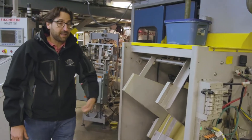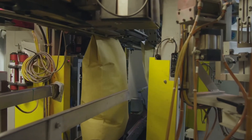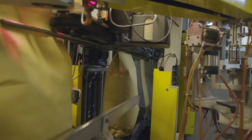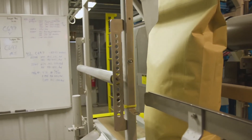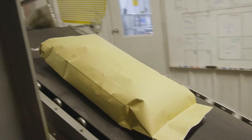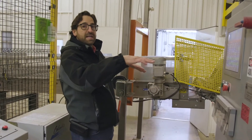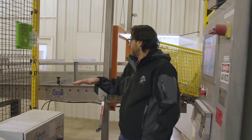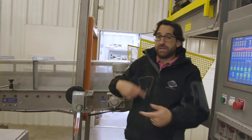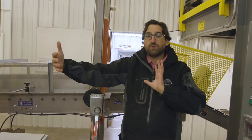We load the paper bags into here and it automatically picks up the paper bag, hangs it, and fills the bag to a predetermined weight before dropping it. It continues to hold the top of the bag as it takes it from station to station. This is an automatic tag placer — we have the ability to put two different tags on at one time, and it automatically applies the tag as it heads to the sewing machine where it gets sewed, printed, and kicked off. We adjust this conveyor to move the seed in the bag so it's flat and full from top to bottom for good stacking, and then square tubing gently vibrates the seed across the entire bag to help flatten it out.